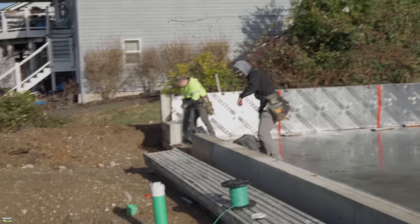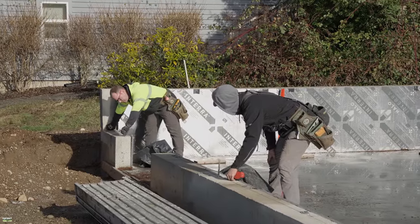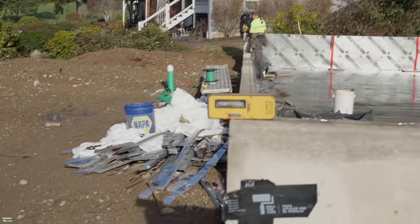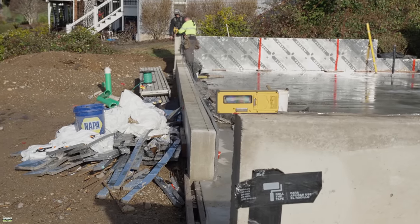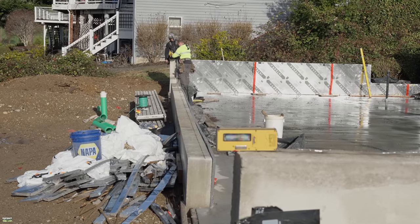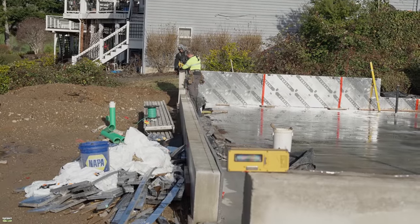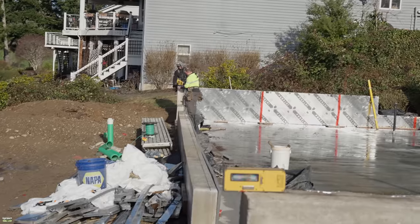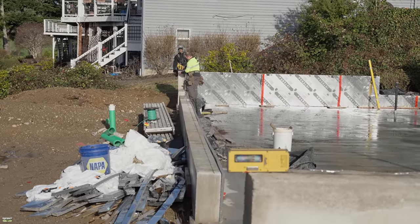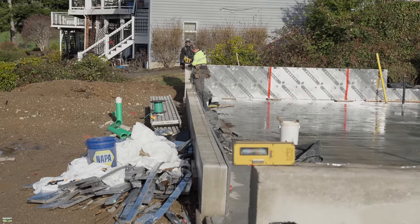I've got this mark — we'll just be able to plumb through. Don't let the chalk line hit the wet slab — it's a quick way to ruin chalk lines. I'm going to plumb up real quick. Did you figure out the methodology? The laser was set in the foreground, shot 64 feet across the back. We squared up to the right of you as the viewer. Now we're on the opposite side, squaring right back at you, same wall as the reference, to square up that far wall.